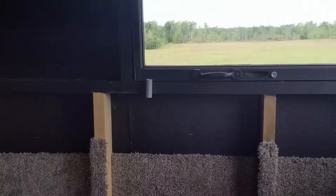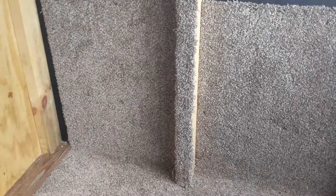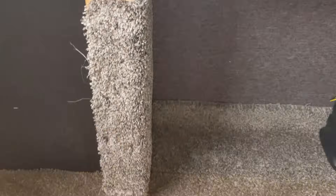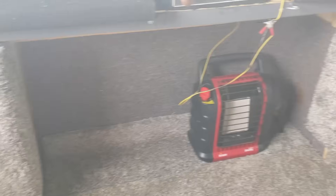I painted everything flat black, at least what you can see from the outside. Before I put the walls on, I had some leftover roof felt or tar paper, so I stapled that onto the inside of my plywood before putting it on the walls. And the OSB on the ceiling too — I stapled it so I didn't have to do all that painting. On the bottom, I bought some carpet remnants at the home center — a 6-foot wide by 12-foot piece — and I rolled it up the sides too so backpack straps and boots won't make a bunch of racket.